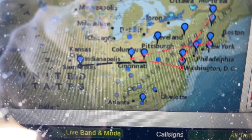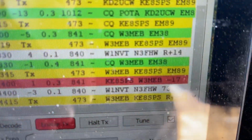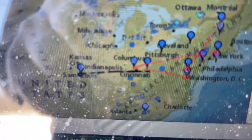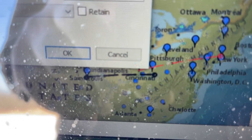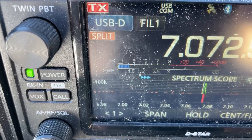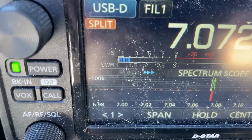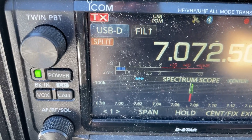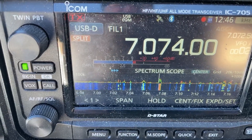Missouri is coming in right there. Signal report is minus 17, but it'll decode down to minus 30, so it's not horribly bad. But he's pretty far away, so I'd expect the signal report not to be great — he's outside the realm of where we're really trying to communicate. We want closer. Here's another good verification of our antenna setup: SWR during transmit is under 1.5. We've got coax connected to the radio — that's perfect SWR.